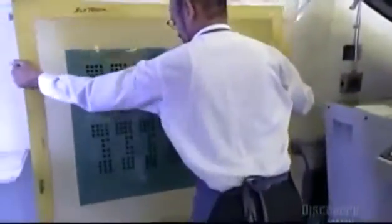Then using this machine, they expose the screen to 2,000 watts of ultraviolet light for up to 6 minutes. The light hardens the chemical on the parts of the screen that aren't shielded by the design on the acetate. This blocks the screen's minute holes everywhere except in the design. Workers remove the acetate film and rinse off the shielded chemical that didn't harden. Now they have a screen stencil of the design they're going to print.